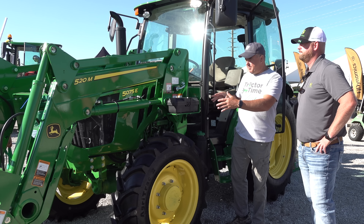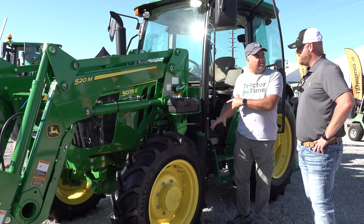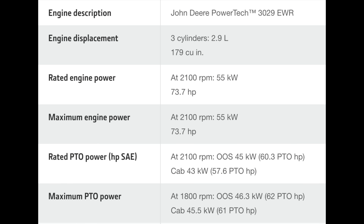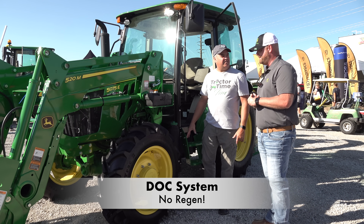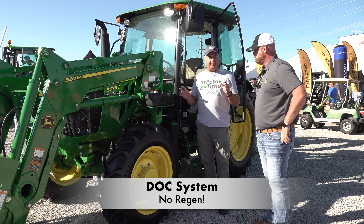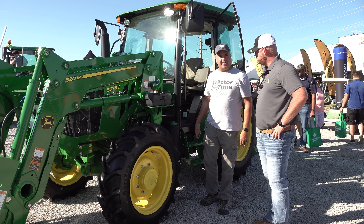The loader looks the same — I don't see any changes there. Brand-new engine for model year 23. This tractor in the past never had to add DEF or a DPF filter, but if you were operating at low speeds it would go through a regen process. With this tractor now, no regen. Just get in the tractor, work, and the regen takes care of itself through a diesel oxidation catalyst engine. No more regens — we've all dealt with regens for nearly 10 years, and I'm glad to see that disappearing.